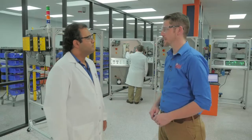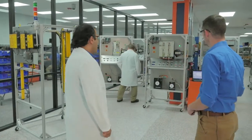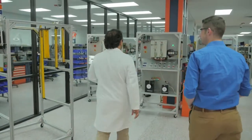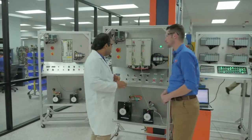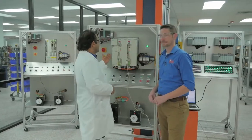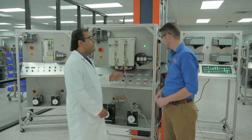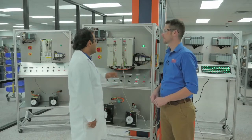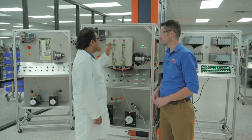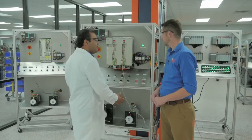One of the number one questions I get asked from my customers is about servo technology. Can you tell us a little bit about the Siemens Master Drive setup that you've actually built? Of course. We have a lot of customers for the Siemens Master Drives. We can test in these racks all the different types of power supplies, servo drives, and servo motors with different types of encoders — incremental encoders, absolute encoders — and different types of power ratings and horsepower of the servo drives. We can test the whole unit in this rack as a portable.